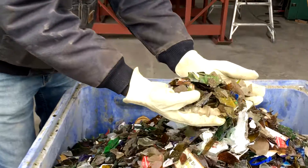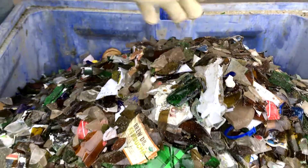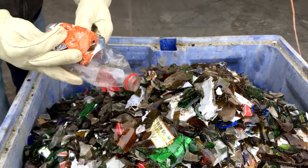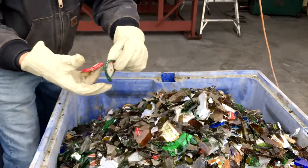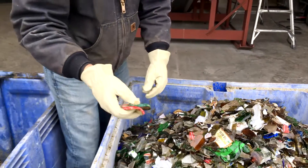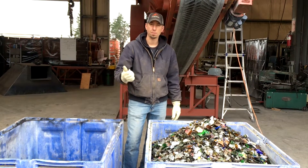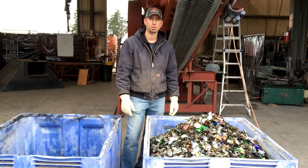You can see the glass crushed down really nice, but also any plastic or aluminum goes right through the jaw crusher, so this can be screened out or eddy currented out. We also get all the steel lids free from any glass, so this can be brought out with a magnet. This is the kind of results we were looking for — we got volume reduction, and we liberated all the non-glass and the glass particles so they can be separated down the line. I think it was a great test.